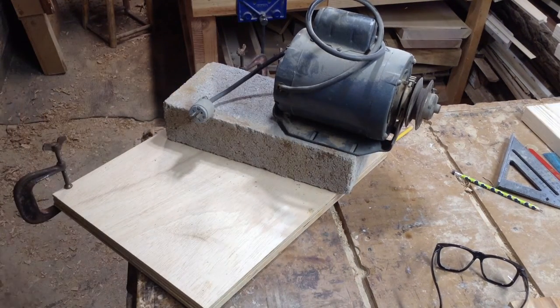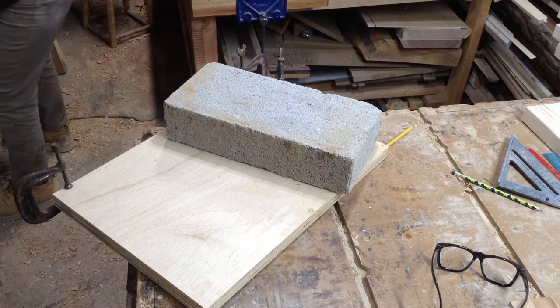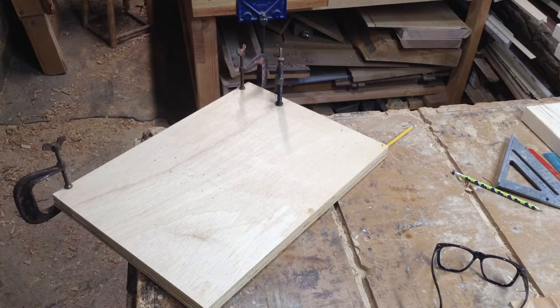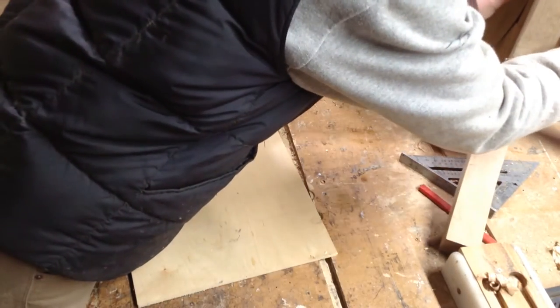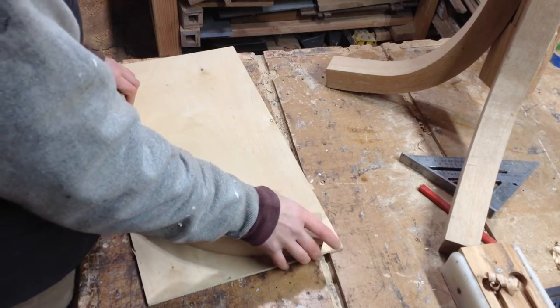To start off this video I'm making another bending jig to hold decorative elements on the legs that will hold up a circular hoop which your feet can go on. I started by laminating together a bunch of sheets of quarter inch Luan - quarter inch Luan is more like three-sixteenths of an inch. I think this was five sheets because I wanted to make these three-quarters of an inch thick. In order to get the original shape I'm going to be bending, after I glued together that laminate, I made a pattern off the leg.